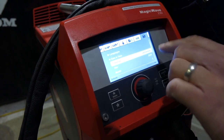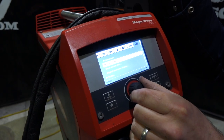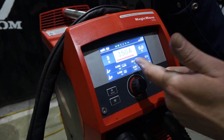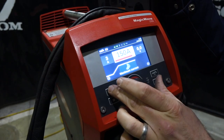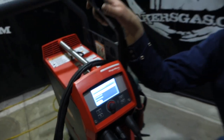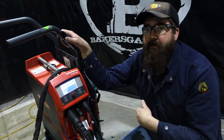Now remember, this is all going to come in from the central time zone. Show system data — it's going to give you all your input kilojoules, that kind of thing, coolant temp, all this stuff. That's pretty neat. Go back to menu there. And then expand parameter display — so if you want to expand what shows up on the home screen, we can add it; there are three different slots and we can add parameters to the home screen so we don't have to keep going back into the menu to change all that.